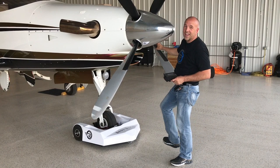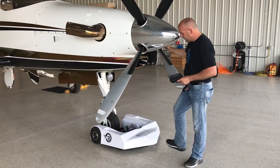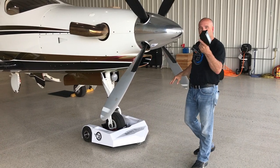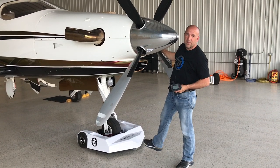It's designed for the kick if you need to give it a kick, but we would just say put your foot under there and give it an assist — just like that, it just takes a little bit of pressure. Because this is a one-handed control for throttle forward and reverse, if you need to you can grab the prop and stabilize yourself to give it a push.